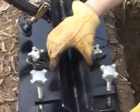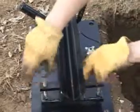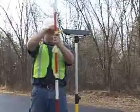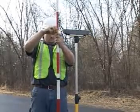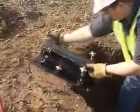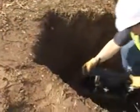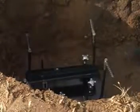Launch cradles provide a stable means to launch piercing tools. They aid in alignment and grade adjustment of the bore. Align the stake and sight by placing the tape on the stake where it aligns with the center point of the scope. Put the aiming stake in the exit pit at the desired exit point. Position the launch cradle on the pit floor and securely stake it down.